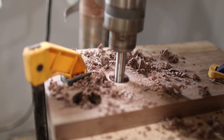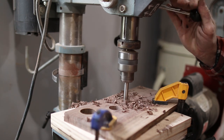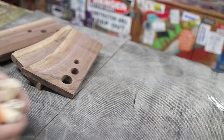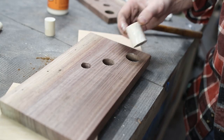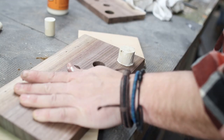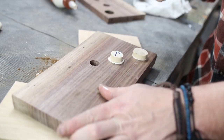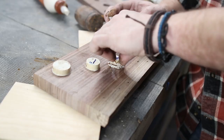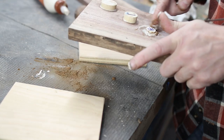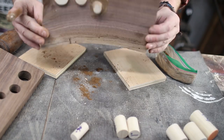There's no rhyme or reason to the spacing or location of the holes, but I decided on three which symbolize our three girls. I applied glue and hammered in the first two dowels no problem. However, the three-quarter inch dowel was just a little bit loose in the hole. No big deal — I always keep sawdust from different wood species in my lunch baggies, so I mixed it with some glue to make my own wood filler, which matched up perfectly.